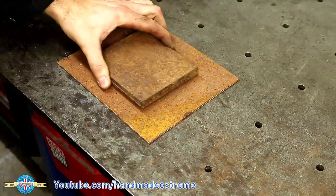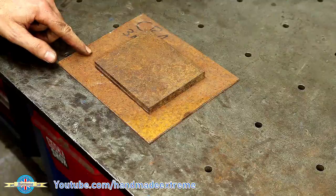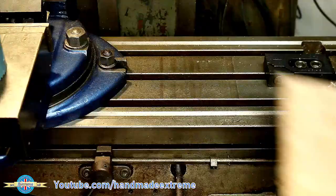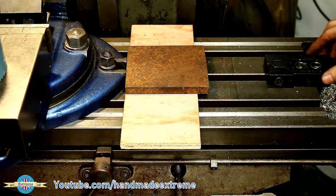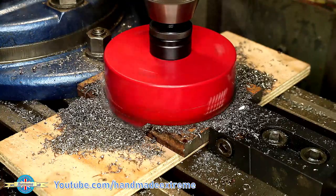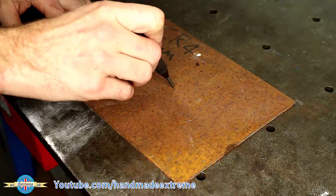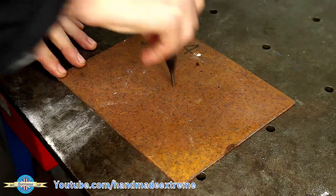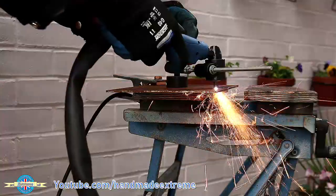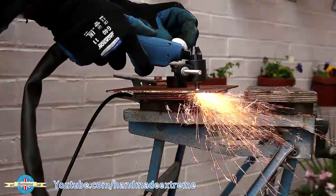To do that I've got a couple of bits of scrap metal here, just a bit of mild steel. This will be a flange and this fat bit here will be the hub in the center. I've just marked out for a hole in the middle and popped it in the milling machine, using a hole saw to cut out the hub. Then on the flange, I've used the little plasma cutting circle tool I made in one of the other videos to cut the flange out of the thin piece of steel.